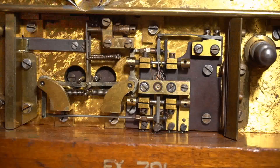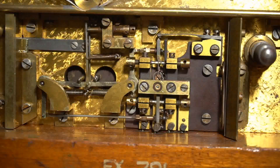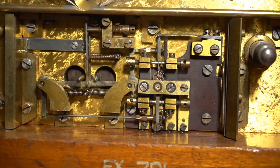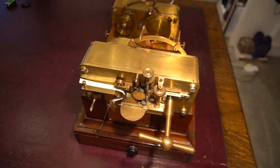Last time I didn't give you a long enough shot of the transmitter, which is I think an awesome device. It's claimed to have a top speed of 500 letters per minute, which is only half the claimed top speed of the receiver, so I don't know what was supposed to drive the receiver at 1,000 letters per minute. With my little 6V motor the transmitter runs at 300 letters per minute, which means the length of a dot is 20 milliseconds, which I think is pretty amazing.